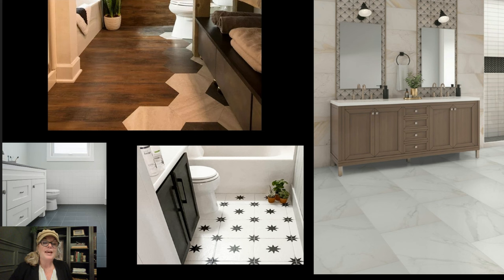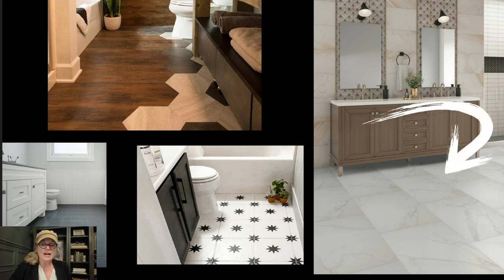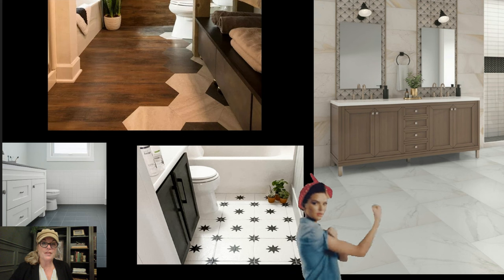On the right-hand side here, this marble floor is actually a very thin tile veneer. It is real tile, however it's super thin and can be installed over top of existing tile. It's large format — a lot of them are 24 by 48 or even 48 by 48, which is awesome because you have a lot less seaming. However, somebody has to carry that sucker in, so get your big strong friends out for that one.